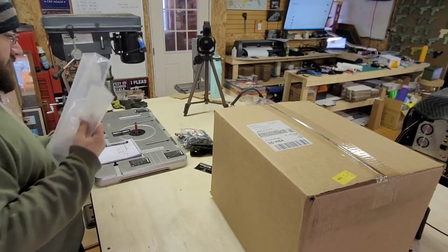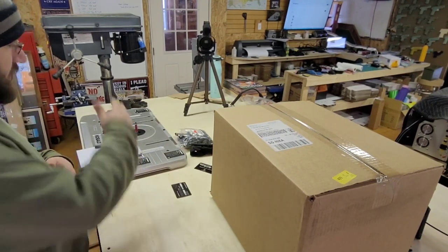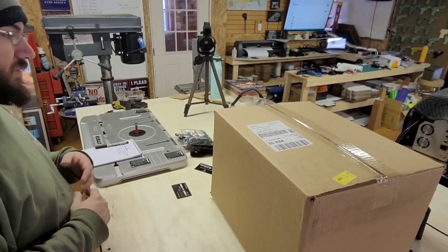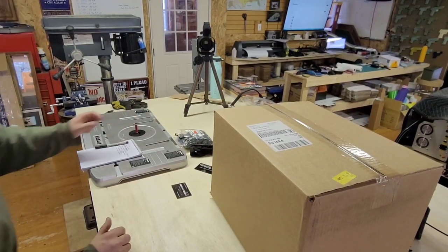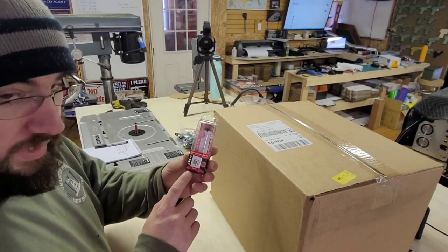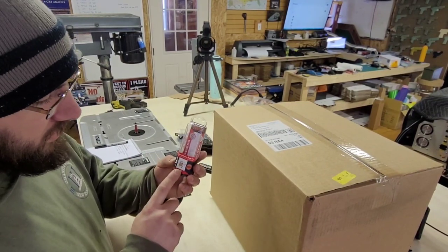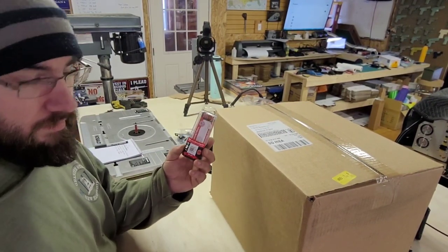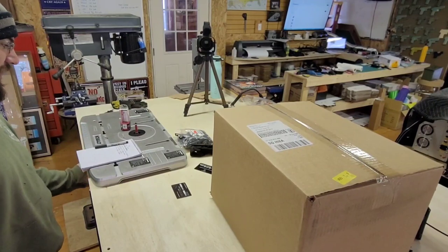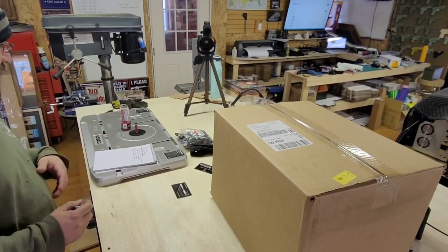I got my router bit in so I'm excited, because now all I have left to do is build a little wall section so I can start using the router — it throws some chips and I don't want that all over my shop. The router bit on Amazon is part number 50-501, made by Freud — F-R-E-U-D — I'll put that in the description. This is a top and bottom bearing flush trim cut, which is what you want for doing holsters with the trim jigs. I installed it, set the height, and I've got power to it already.